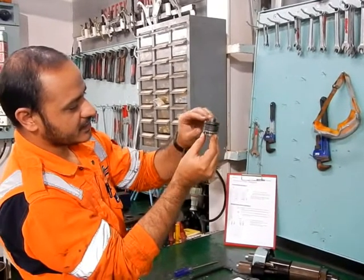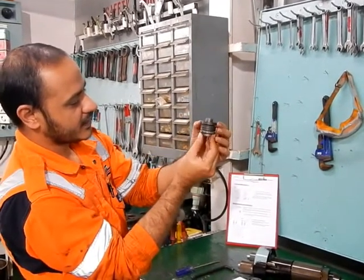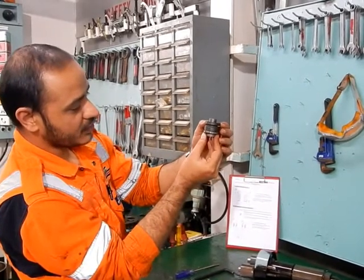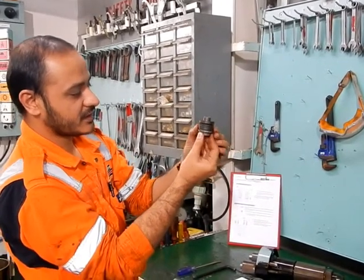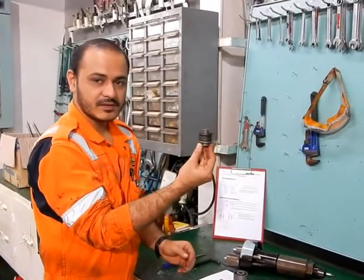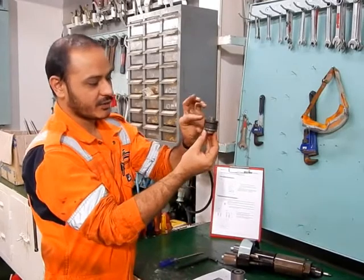So the idea is that on our injector, the nozzle holder should not move in the cylinder cover. That means when you are tightening it, it will be metal-to-metal contact.